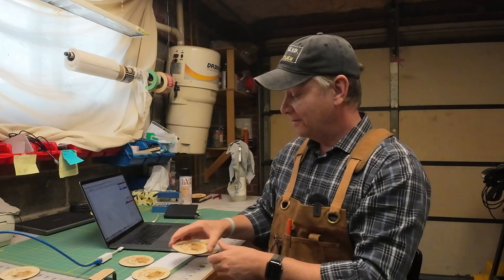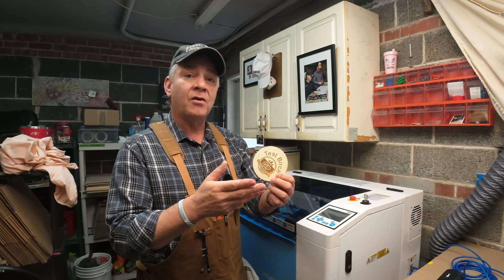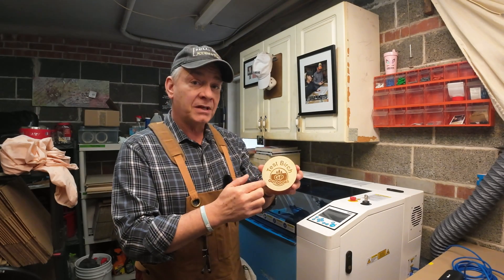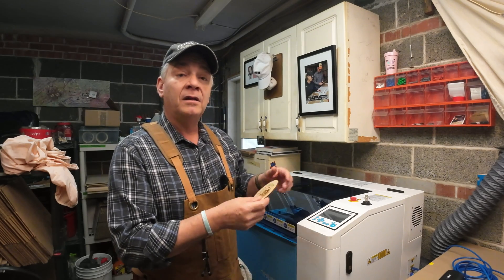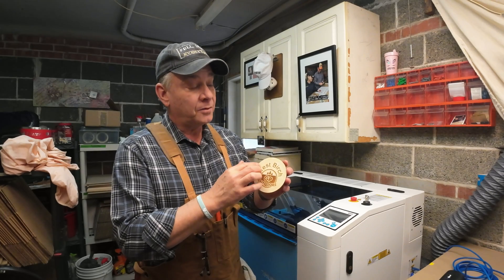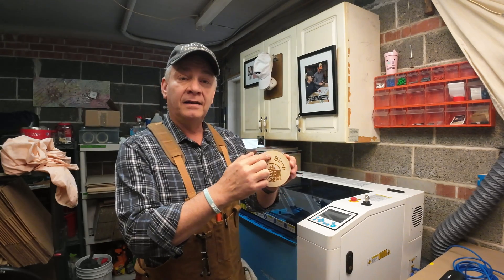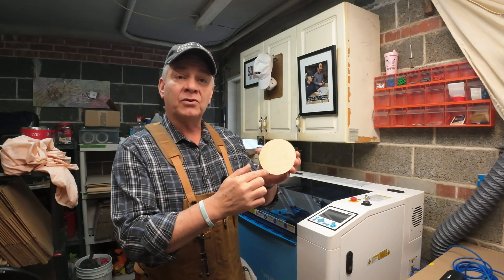Interesting contrast on the cut layer. I tested between 50 and 70% power, as well as between 20 and 30 millimeters per second. I found combinations where it would cut all the way through but just barely, and depending on the crown or warp in the wood, most of it would cut but then I'd have to snap the back out. I also found that if your power is high and your speed is too low, you're going to get a lot more scorching around the cut, and in some cases what I think they call flashback — where you start to get scorching on the back of the piece.